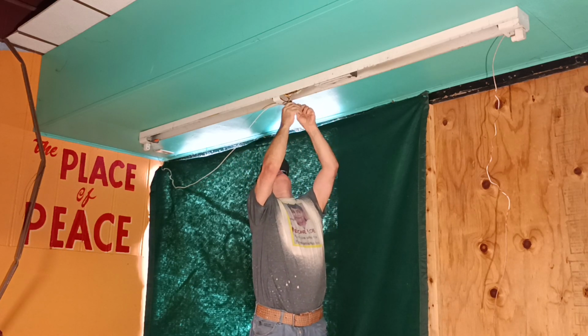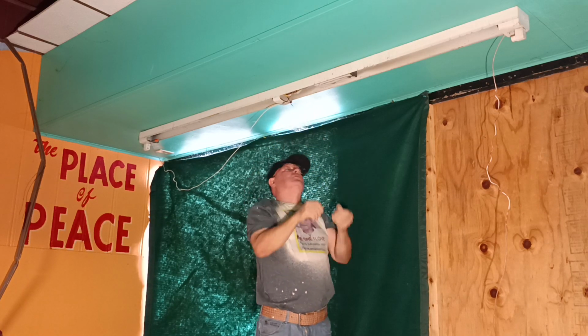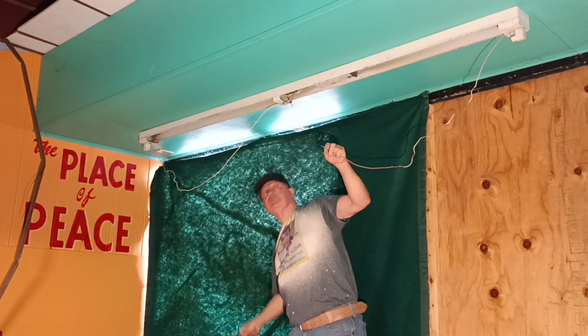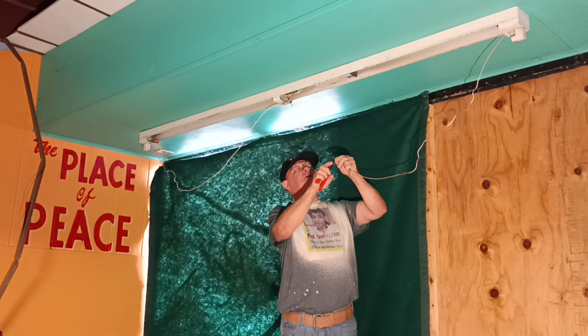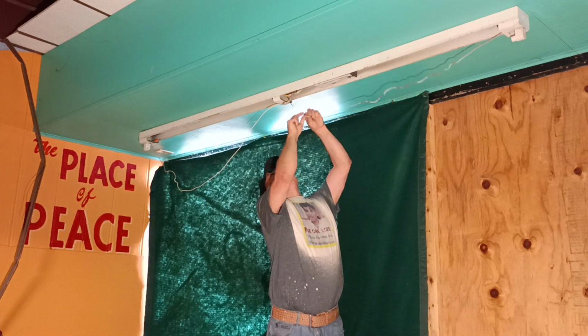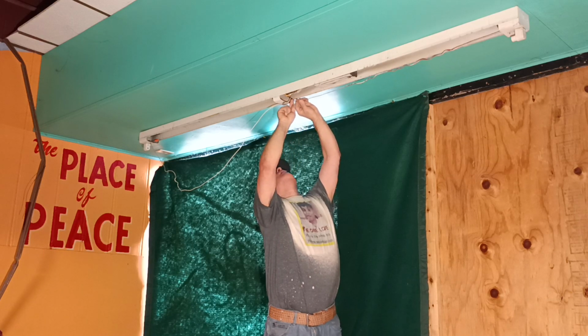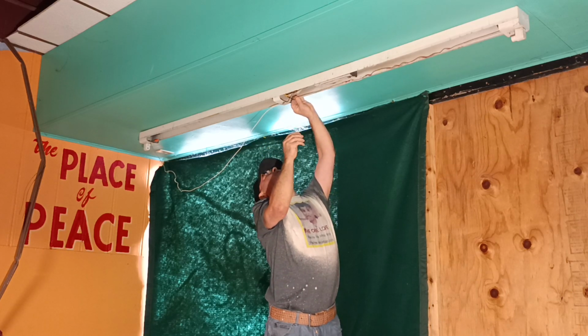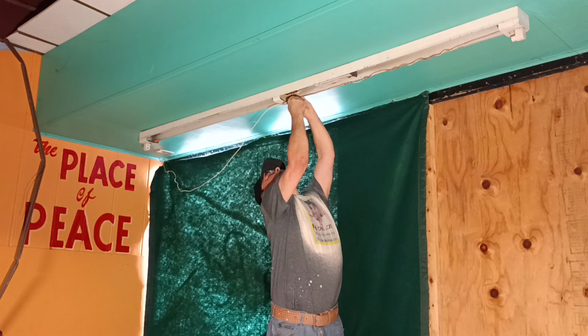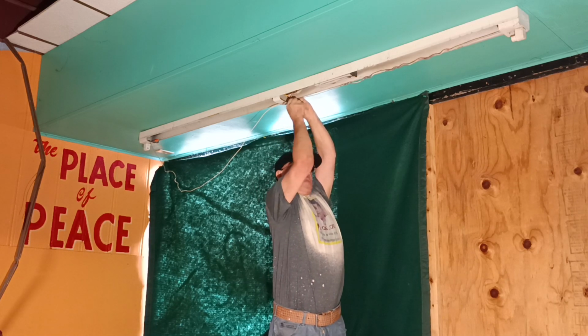We'll take our black wire down here. And we'll take our other wire. This goes to our other end. Strip it here. Okay, we'll make sure our copper is even at the end and our insulation even at the top. Put our wire nut on. And we'll make sure they stay even here. Okay, our wire nut nice and snug here.